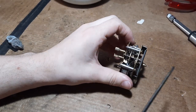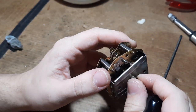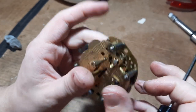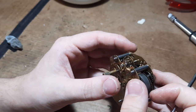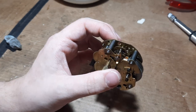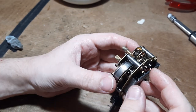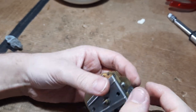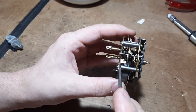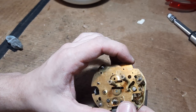At this end here, the delicate end, is a balance wheel - this fast-moving wheel. And it is connected to this very fine coiled spring called a hair spring, or balance spring. One end of it is on the wheel and the other end is actually connected to this plate here - in this case by a blob of glue which looks like nail polish or like a strawberry fruit lolly or something like that. The end pivot of it is held in with this screw, so you can remove it also without disturbing any other components.